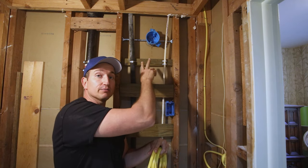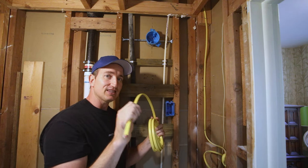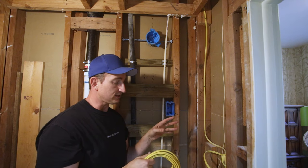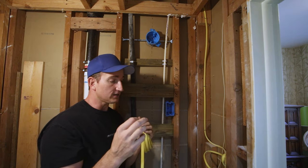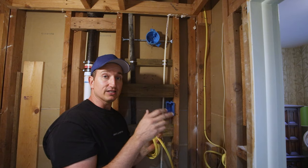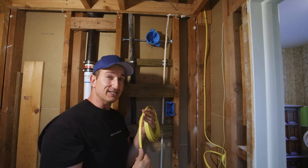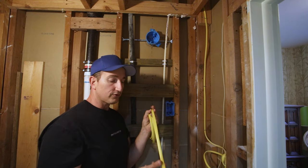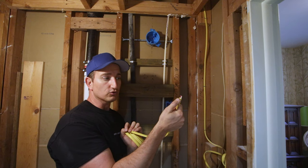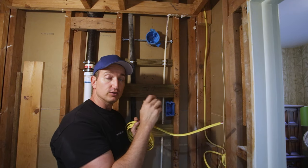I'm going to use 12/3 wire. 12-gauge wire is relatively heavy gauge — these LED lights aren't going to draw much power and don't necessarily need thick wire. However, this is a bathroom circuit and it's a 20-amp circuit, so technically everything should be run on 12-gauge wire. The theory is that if anyone ever plugs in something too high-powered, thinner wire can melt before the breaker trips — so I want heavy gauge wire to keep everything consistent. 12/3 wire has four wires: red, black, ground, and neutral. The red and black will be your hots.